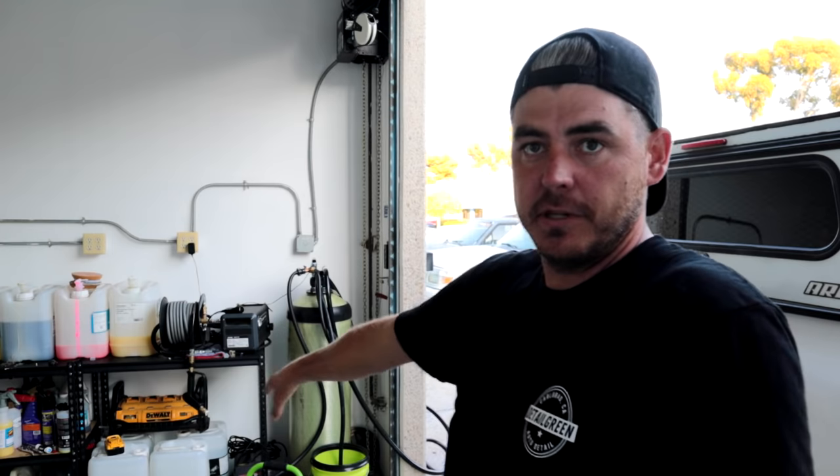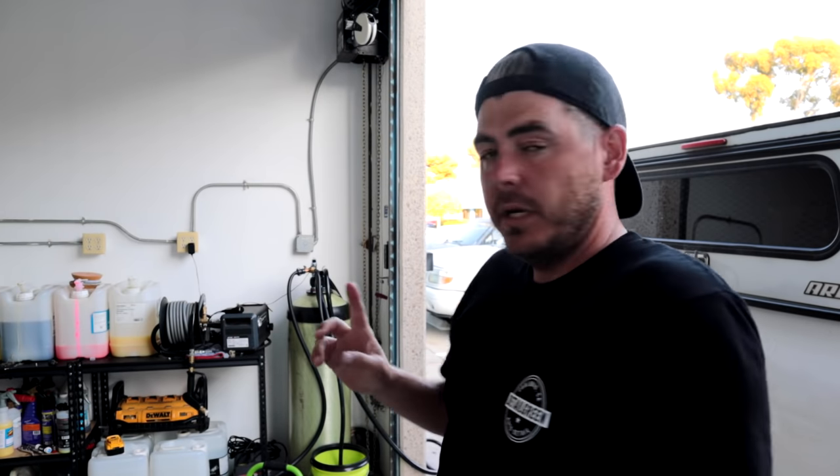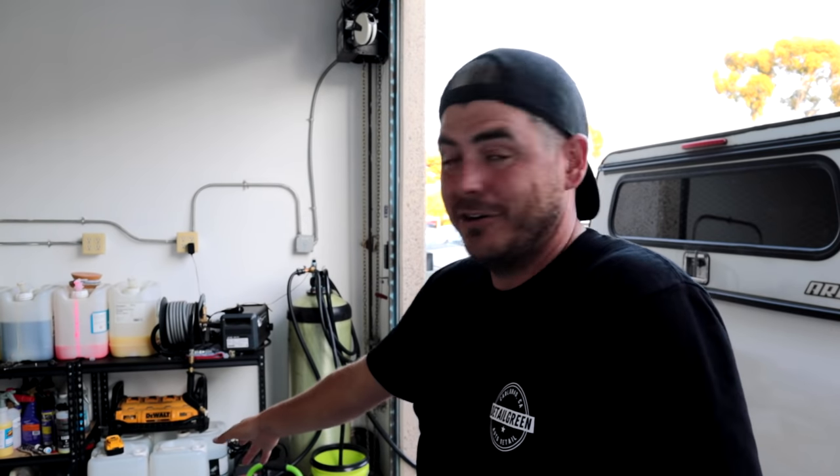With that said, I don't really like the way it sounds. The decibel reading doesn't show it's that loud, but with the constant hum in the shop it does echo. Usually you're working quite a ways away from it, especially with a 50-foot hose, so noise isn't a huge issue. I don't know the longevity of the machine — it's an induction motor so it should be pretty good — but that jet flow technology fluctuation gives me pause. The numbers though, I am very, very impressed. We're going to switch over to the 3000 PSI unit now and run through the tests quickly.